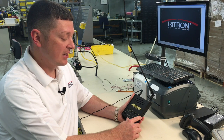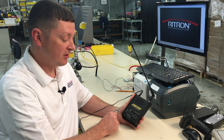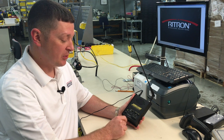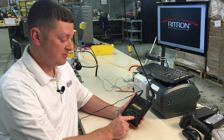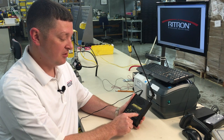Once we have the dash on the display we're in programming mode. We'll go to channel two and then begin entering our values. The first letter that we'll see come up is an F for frequency, and we'll put our frequency of 20 in — two, and ten times for a zero. Press the on button to save.